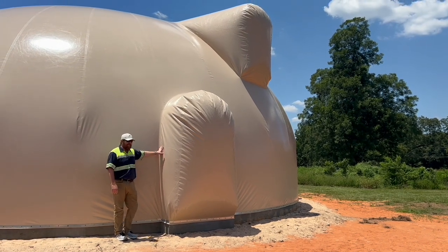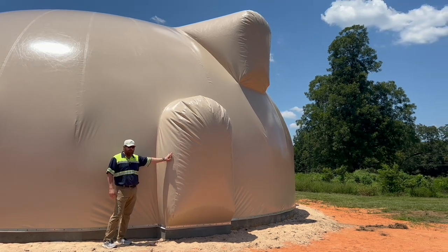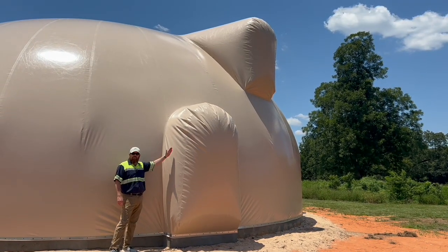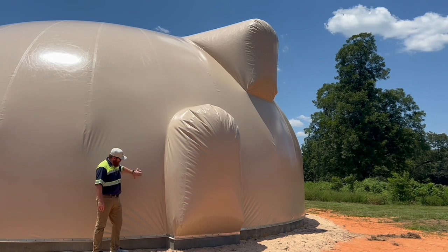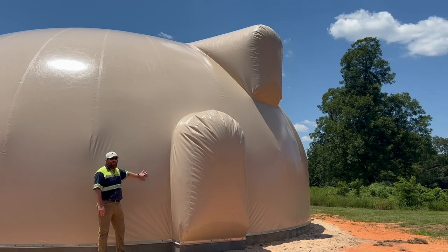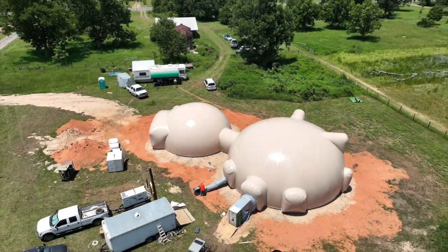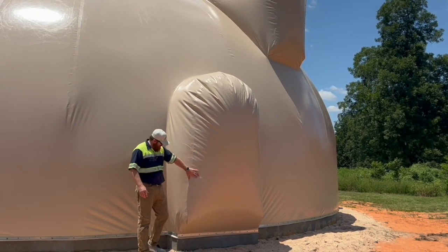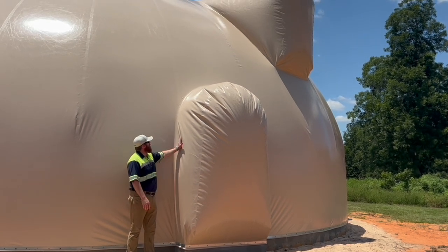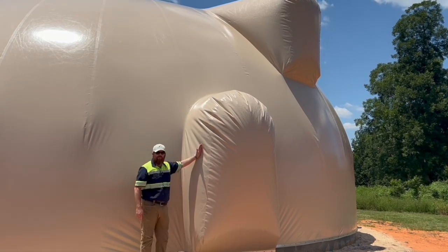This augment is called an extended augment. It extends from the dome's diameter to create a little bit of a rain and solar shield for the window or the door that goes inside this augment. Right now the dome is inflated at low pressure. We do that at first so we can make sure we've got everything squared away inside before we turn it up to its actual design pressure. You'll notice that there's a little bit of an extra pillow here — that's actually a sacrificial part of the fabric. The frame will be put back here so that all of this wrinkly bit of fabric will be cut off and removed before the dome is built.